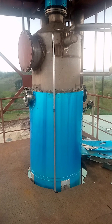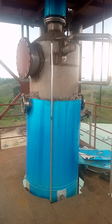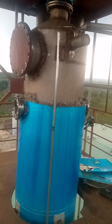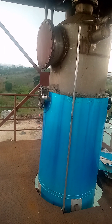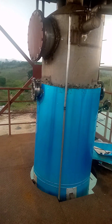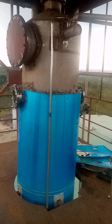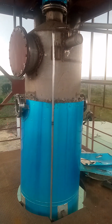When the vapors enter the rectifying tower, they ascend to the top condensers. We use beer to preheat so that we have sufficient heat efficiency and reduce the load on water cooling. The vapors are sent to the beer heaters, then from the beer heaters they flow to the main condenser.